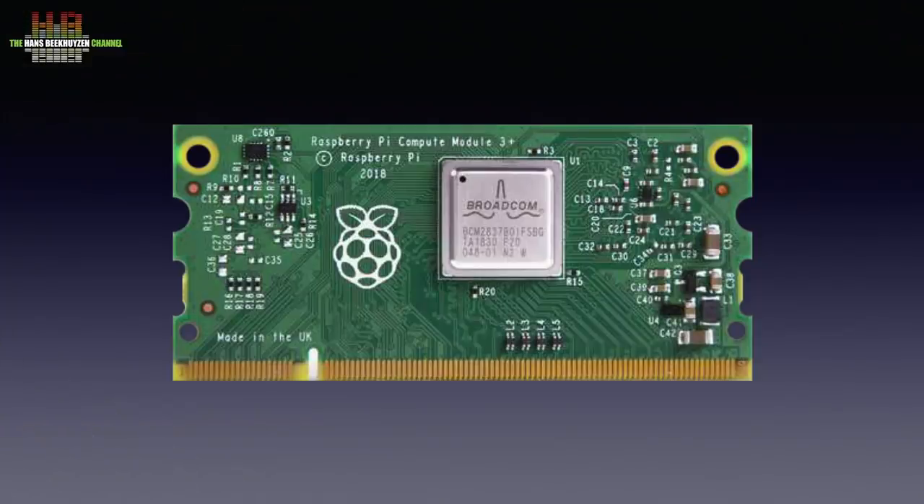With the USB Bridge Signature on review here, they made a clever move. It maintains the software flexibility and robustness of the Pi, while at the same time opening the possibility to design audio-optimized interfacing hardware. They use the Raspberry Pi 3 Plus Compute Module on an audio-optimized circuit board. The Compute Module is the heart of the Raspberry Pi on a circuit board the size of about a DDR2 memory module. This module is also used in non-DIY products.